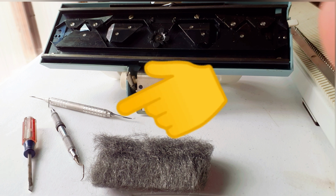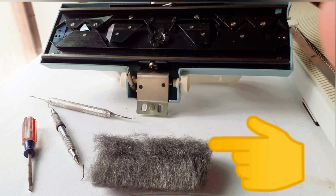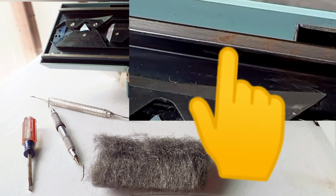Some dental tools are, of course, actually designed for gently getting deposits off teeth without damaging the enamel, and they worked really well. The original purpose of the steel wool, the finest you can possibly get, was to get off those little tiny corroded spots, and it does work well for that. It takes patience and time, but you still want to use the finest. The goal is to make things smoother, not rougher.